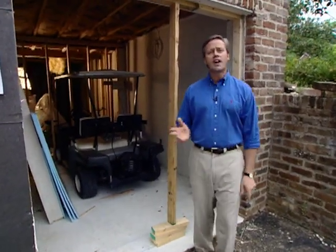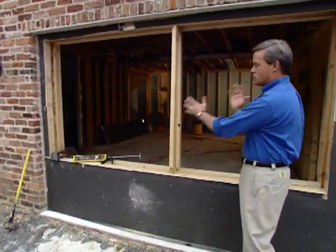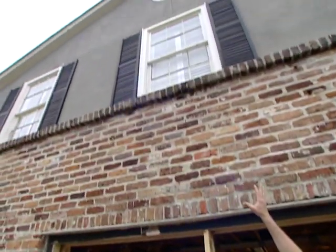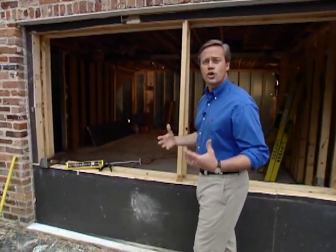Now, we're using a fiberglass door in this case because we expect a lot of rain down in this area to have a backsplash against the doors. Wooden doors wouldn't hold up very well, so fiberglass is a perfect alternative. Now, here in this large opening, we'll have 3 windows that'll be positioned side by side. These will be single pane, non-insulated type windows that'll match what we have in the existing part of the house. This is always a key factor when you're trying to blend the new with the old. Make sure you use the exact same windows whenever possible.